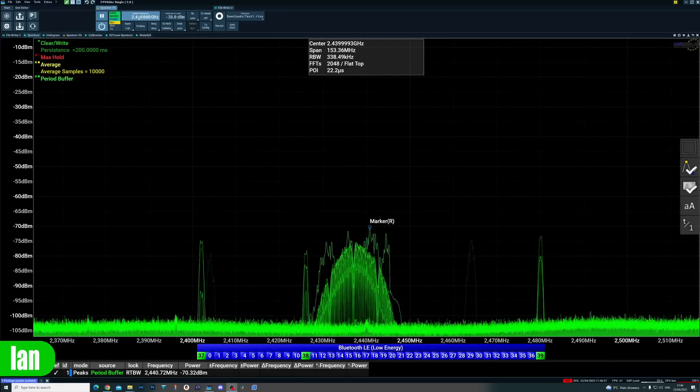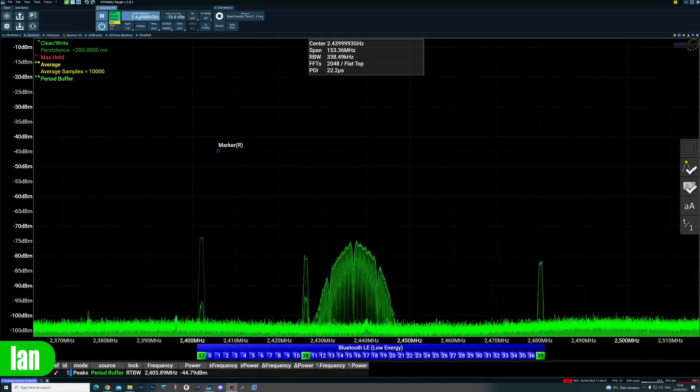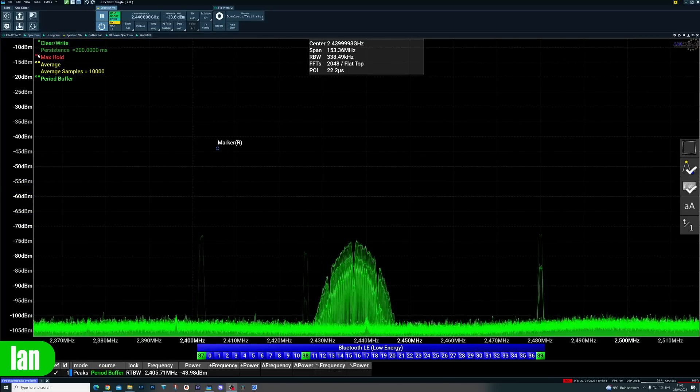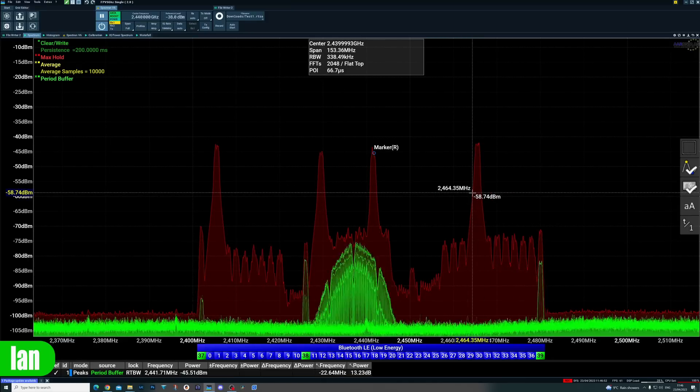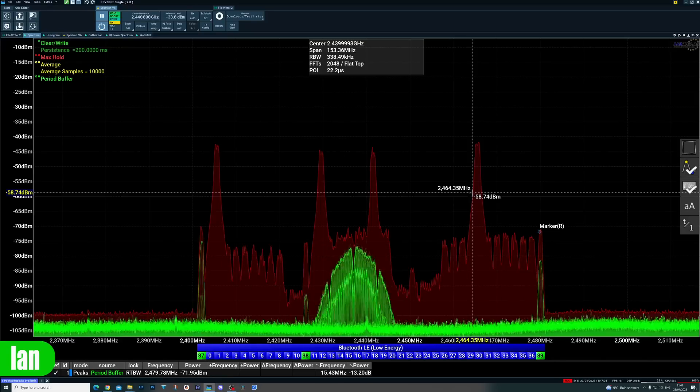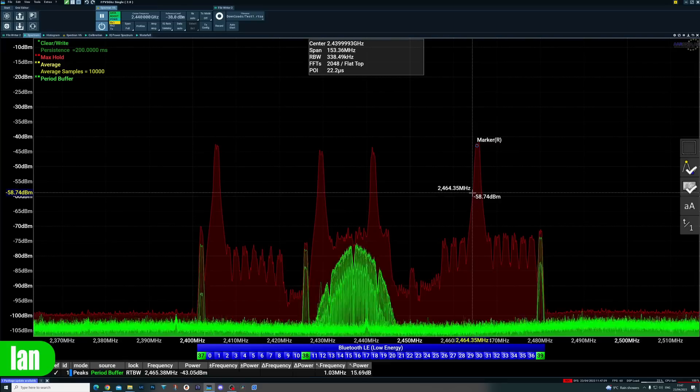Dropping down to 2.4 GHz just to check there's nothing dramatic here. There is a pulsing carrier visible — with max hold you can see these tall spikes from the goggles. These are a sort of placeholder or band-checking carrier — not really fast enough to be carrying great amounts of data. They could be carrying some data but they're more of a polling carrier whilst the system is on 5 GHz. Turning on broadcasting mode down here — as you can see, nothing has changed. There appears to be no additional output from the goggles at all. It's just changing the stream ID and making it visible.